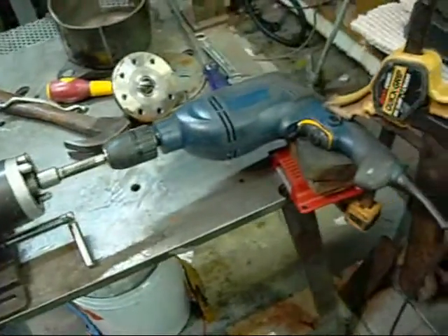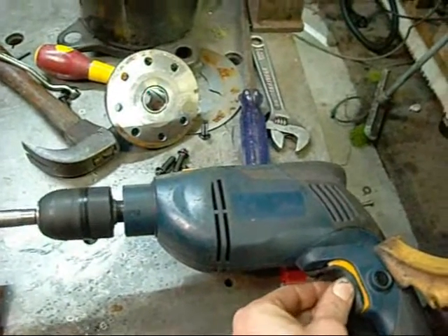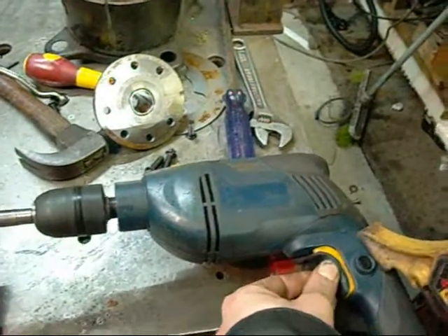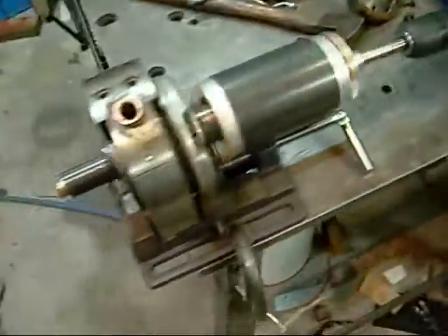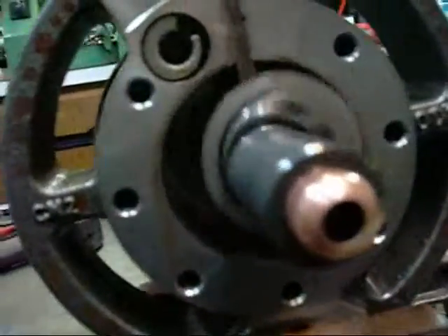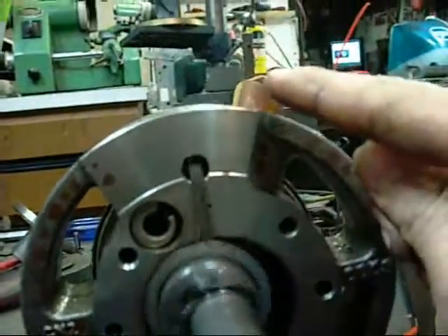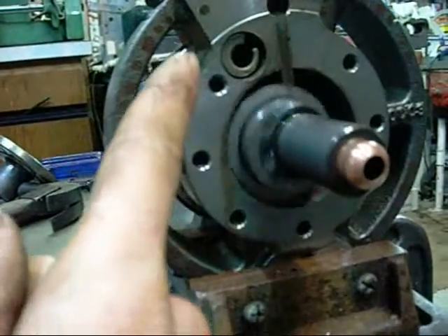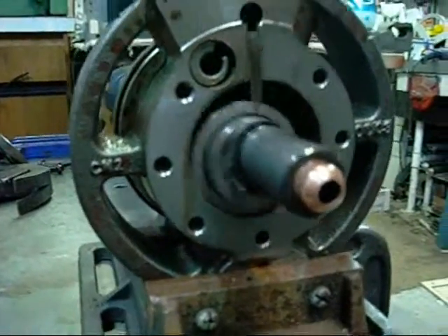It's crude, but I think I've found the best way to demonstrate these compressors. It's running in the correct direction and basically all it's doing is drawing gas from the suction side of the compressor down into this chamber, just squeezing it around against the seal and out through these little reed valves. Of course this isn't compressing anything because there's no head on it.